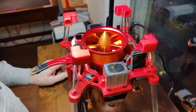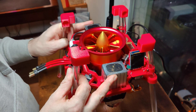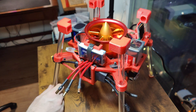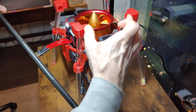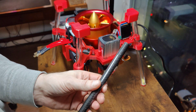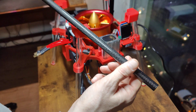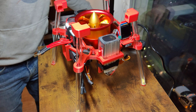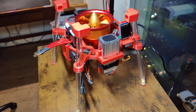Anyway, that's where she's at right now — not even close to being done. One last thing: these legs are just cheap acrylic, about $5 for all four on Amazon, but the legs and all bars will actually be made out of 14 by 12 millimeter carbon fiber tubing — 14 millimeter outside, 12 millimeter inside — to hopefully increase strength and reduce weight. So I'm going to wrap this up now. Thanks for watching — let me know if you have any questions.